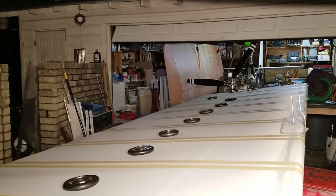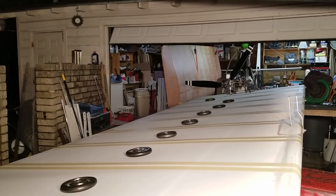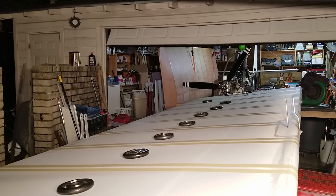Okay, Affordaplane Builders, Terry back here, and we're going to go ahead and start gluing these ribs on the bottom side. This time I have a little bit neater setup. I've gone inside and picked up a couple of dumbbells and have a bunch of 3-pound weights that I can shift back and forth just to make sure we have positive contact between the ribs.